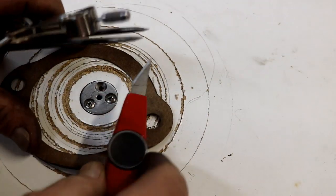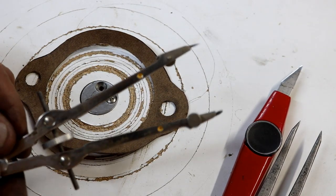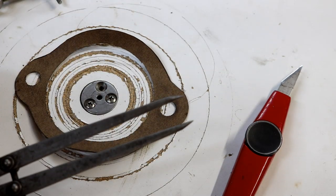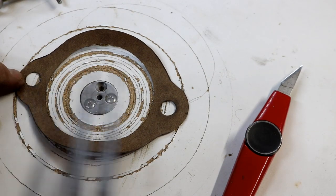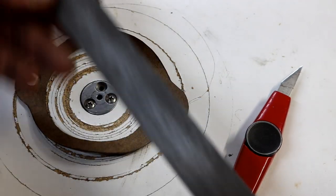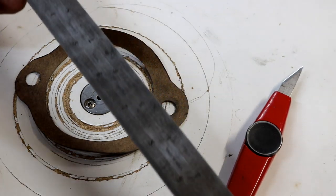You can also cut the outside with a sharp knife. You can lay out your work on your gasket material using a compass for circles and arcs, or a pair of dividers to mark spacing on holes and such. Using a nice metal scale is always handy for those measurements — a tape measure works too.